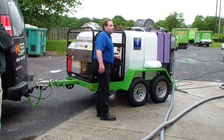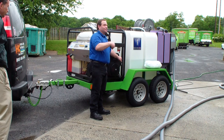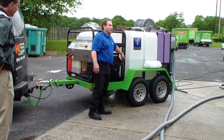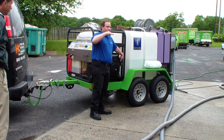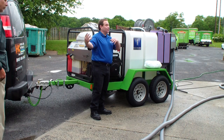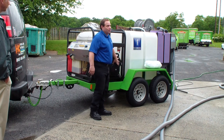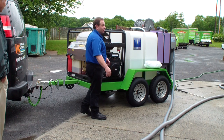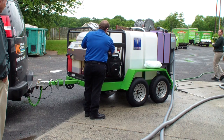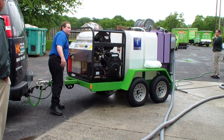You do have a choke. There is a throttle, but it's disconnected. I've had somebody take it and get it fixed. You don't want to do that, because this actually has a 3,000 watt onboard generator. That generator has to be fixed RPM, and a lot of times if they got the idle down, it's because there's no load. But you're always going to have a load, so you don't want to be messing with the RPM. It's always got to be set at like 3450. Under load, 3250.